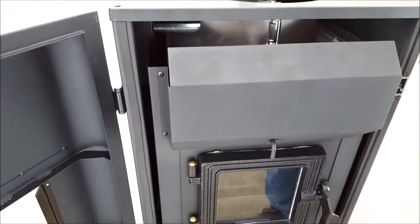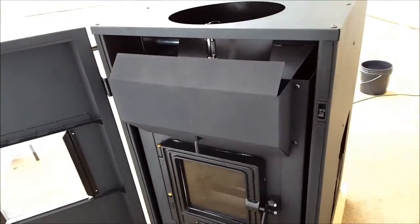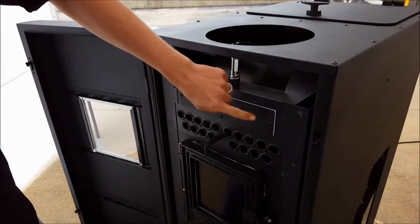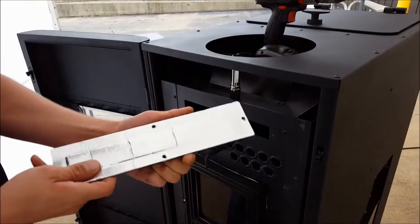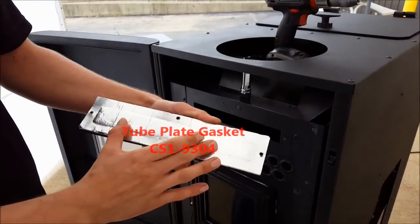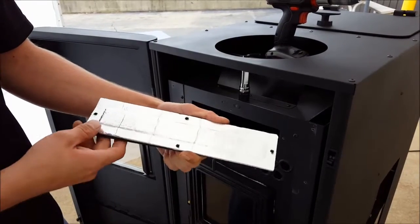Next, we're going to remove the air deflector by taking off the two left and two right screws. This will expose the heat exchanger cover plate and the gasket, so go ahead and remove those four screws as well. Take a look at your gasket, ensuring there's no rips or tears. On this enlarged surface, there will be quite a bit of debris built up, so using a putty knife, carefully scrape that debris off.